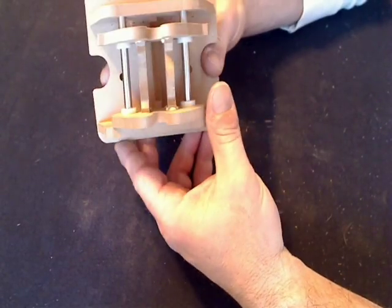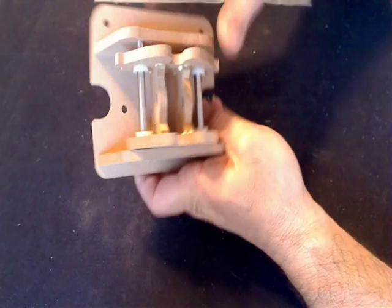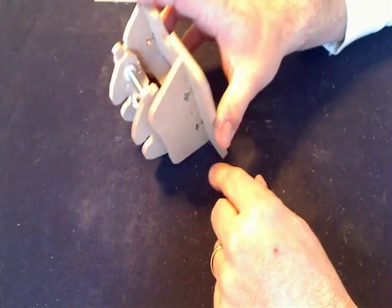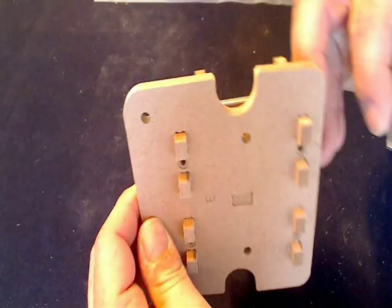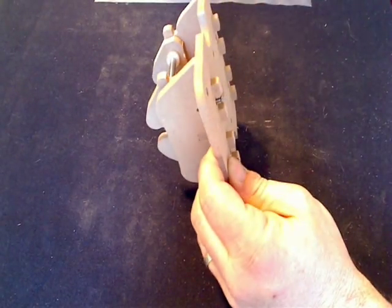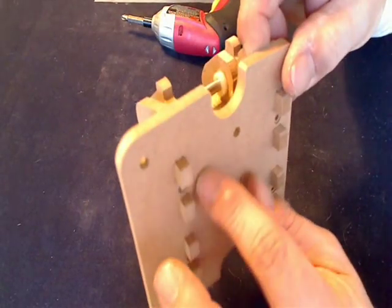In the meantime, I'm going to take my hardware screws and the square nuts — here's what the square nut looks like — and I'm just going to insert it into these T slots here. You can put a piece of tape on there if you want to help hold the nut in place. I'm taking my screw and on the back where my recess holes are, with the nut already in there, I'm just going to push this in, get it lined up, and use a little drill — you could use a screwdriver — and drill that in place. It should go flush. You don't want to over tighten it. There are four of them total.